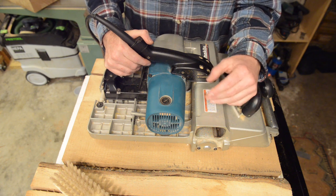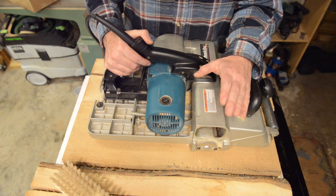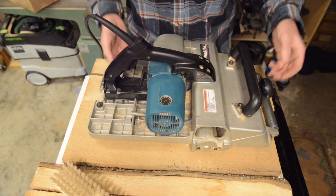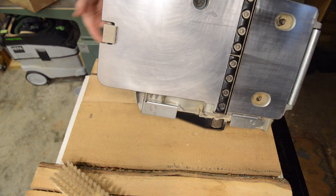It makes a huge difference. If I'm really good about it and don't miss anything, it's entirely possible to do an entire job on one set of knives in pine or many other softwoods — though that would be a different case if you're doing oak, for example.